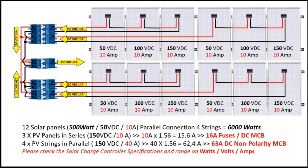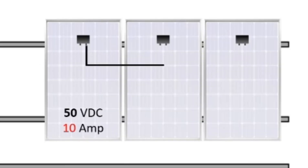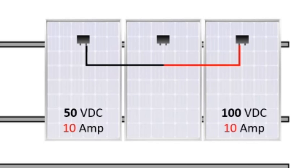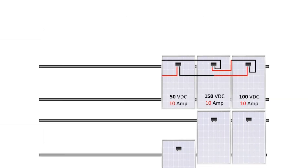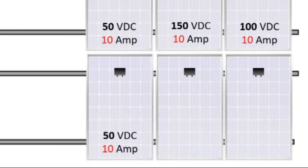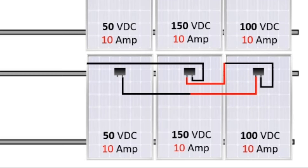We're cross-connecting your parallel against the normal one — see the cable management, that's a reason why we do it this way. If you do a parallel connection, we're first going to do strings of three panels. You go positive to negative, skip one, so you can come back all the way with your wires. In a series connection, you'll see the volts add up: 50 volts, then 100 volts, then the third panel brings it to 150 volts.